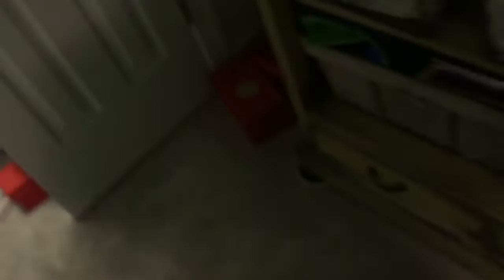That is the panel, and I'm actually using my spare keys for once. This is on code 3, 15 candela. To start it off, we will pull the BG12L and this will go off and the panel will go into alarm. So without further ado, let's go ahead and pull it. Three, two, one.